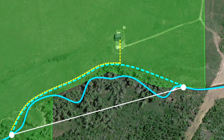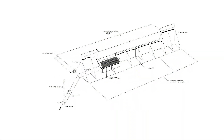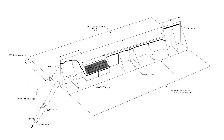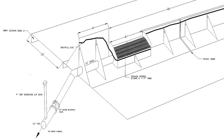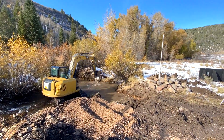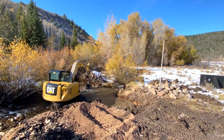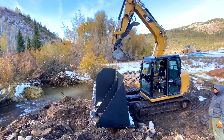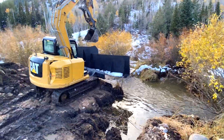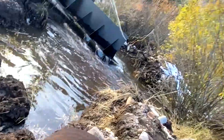Let's take a look at the intake area where a diversion wall has been designed to direct the stream flow through a Coanda screen and into the 12 inch penstock. The installation of this diversion was accomplished with a mini excavator. The stream bed is first compacted and can hold a non-permeable membrane. Then the excavator is used to position the southern section of the wall into position.